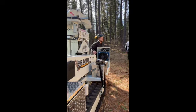That's going to move this whole portion of the chute, and then you got the flipper on the end. You've got 2 clean out portions on this discharge chute, guys, if this ever clogs up on you. If you raise this jack all the way up in the air, you pull this rubber part down, that's going to allow you to hit this end. You've got 2 9/16 nuts right here. You take those nuts off, this door kicks down, that's going to allow you to get this part of the transition.